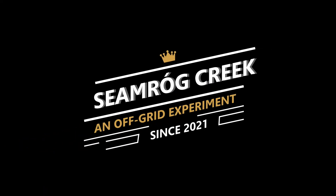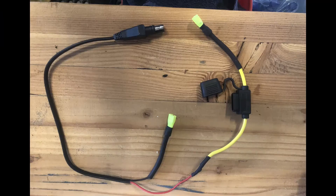What we really want is cameras that are on all the time. Now that we have Dishy up and we have Starlink — hooray — we are going to put up cameras using Wi-Fi that go out to the internet via satellite. This is the first one we're going to do. It's a complete experiment. This camera uses 12 volts, which is awesome. It has a big wall wart you plug into your wall at home that converts to 12-volt DC, which is what I want for solar, so I just cut that off and soldered the end straight on to the connector that the charge controller needs. Boom — solar-powered camera.